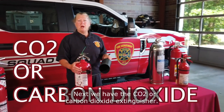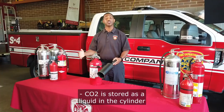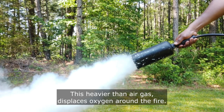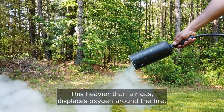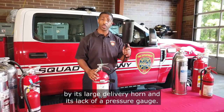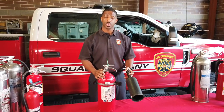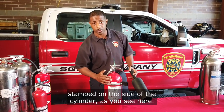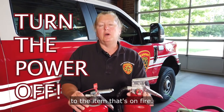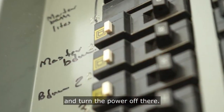Next, we have the CO2, or carbon dioxide, extinguisher. This extinguisher is best used on electrical fires but can also be used on Class B fires. CO2 is stored as a liquid in the cylinder, but when discharged, turns into a gas that is heavier than air. This heavier-than-air gas displaces oxygen around the fire — no oxygen, no fire, no mess. You can recognize a CO2 extinguisher by its large delivery horn and its lack of a pressure gauge. The only way to know if a CO2 extinguisher is full is to weigh it; you can find the weight requirement stamped on the side of the cylinder. When using any extinguisher on an electrical fire, always turn the power off to the item on fire, or go to the panel box to shut it off.